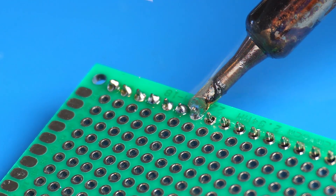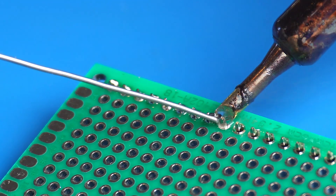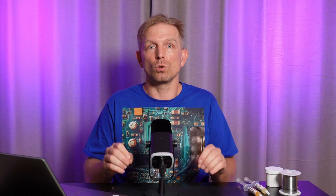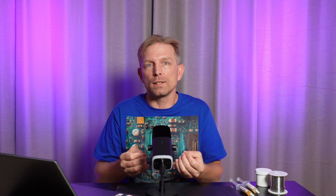Why? Because of excellent wetting. Lead alloys can flow into the smallest holes in a PCB with soldering fluxes of course. Lead alloy creates a strong joint if you properly preheat all surfaces. It also offers high mechanical and vibration resistance because the lead alloy is more elastic.